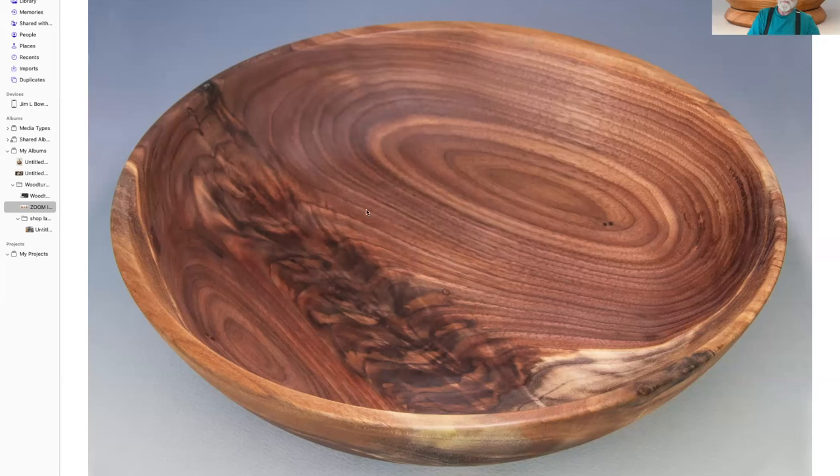Are you suggesting that if I was cutting faster, it would be better on the tear out? Well, I was trying to decide what you were turning at. So if you're turning at 1,000 to 1,500, that's probably enough. If you're turning much slower than that, it's probably not. Then it's most likely, if your tool is sharp, a question of what angle you have sharpened to and then how you're presenting the tool to the wood, which are your other variables. But end grain on all woods is always a challenge. It'd be interesting to hear others' perspectives. Mike, or others, what might you say?